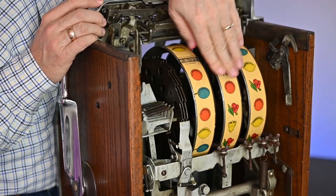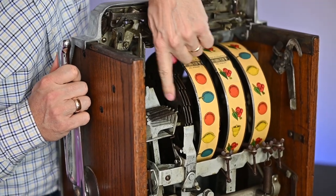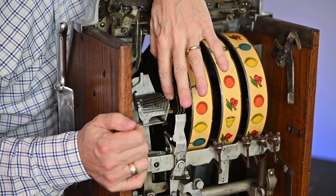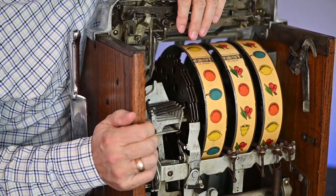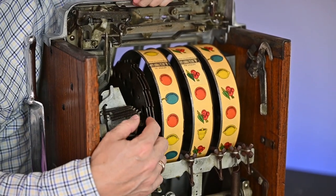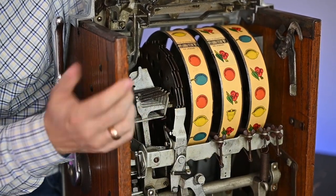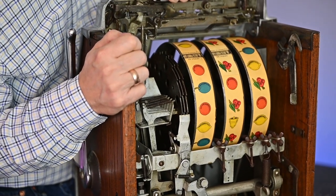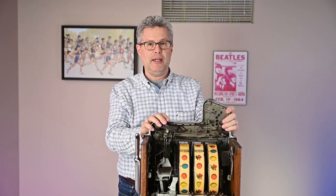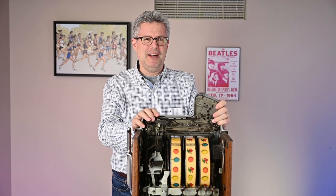Here are the holes, and each reel corresponds to one of those discs — they look like saw blades, but that's just so the mechanism can stop them. They all have different holes, and these are the arms that either go through or don't go through. The way to make it a tighter machine is to block these holes with some kind of metal slug. If you do that, you also have to change the reel strips on here because they would no longer correspond to a winning symbol — so whatever this one corresponds to, you'd put a slug over it and the corresponding symbol would turn into a lemon, because when a lemon shows up as the first symbol it's never a winning combination. This particular machine has nothing blocked, so it's as loose as it can get, which by today's standards is not very loose at all. You could go a long time playing this and not win a thing. That's why we leave free quarters out for people to use — we don't want to take all their money.